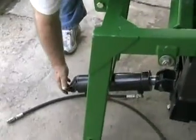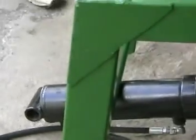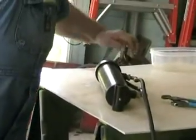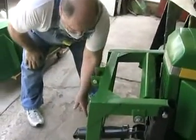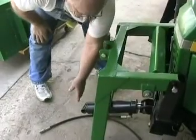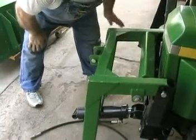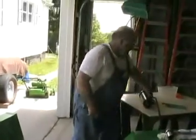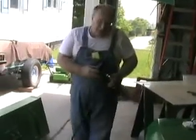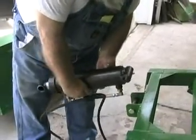One of the cylinders has no grease zerk in the widest end. That's your lift cylinder. The other cylinder is going to have actually three grease zerks. That's going to be your bucket cylinder, so that'll be your clue as to what happens there. As I said, I was concerned about the oil hydraulic hoses pointing down, but once it gets installed properly, it's going to be sticking up here out of the road, so that's fine. But in the case of the bucket, that cylinder has two grease zerks. It goes on here and fastens to the bucket.